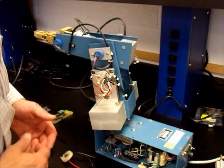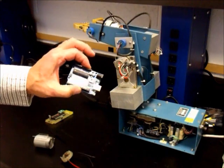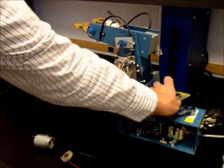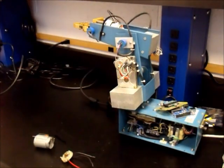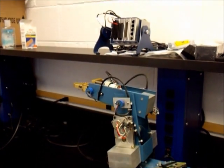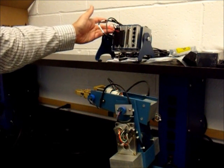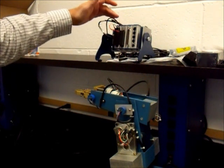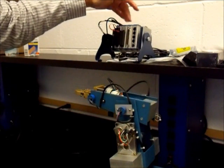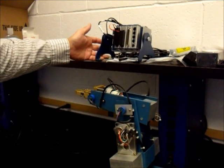What we need now is to make a driver that will control this through whatever device we prefer. We could use an Arduino board to control this, or our own home-built microprocessor board. We also have these National Instruments I/O devices which connect to the PC through a USB cord — they have digital inputs, digital outputs, analog inputs, and analog outputs that we can use to control our boards. It'll all work from a PC using LabVIEW.